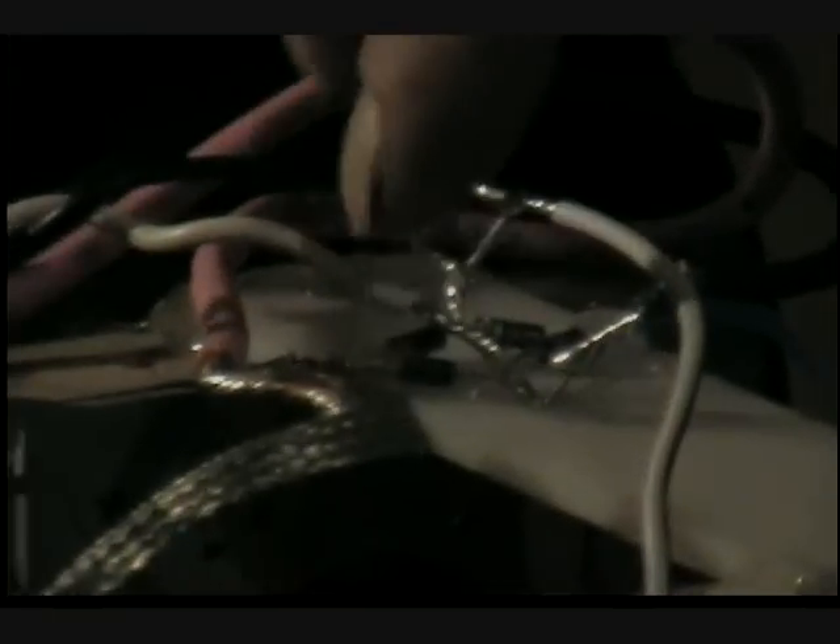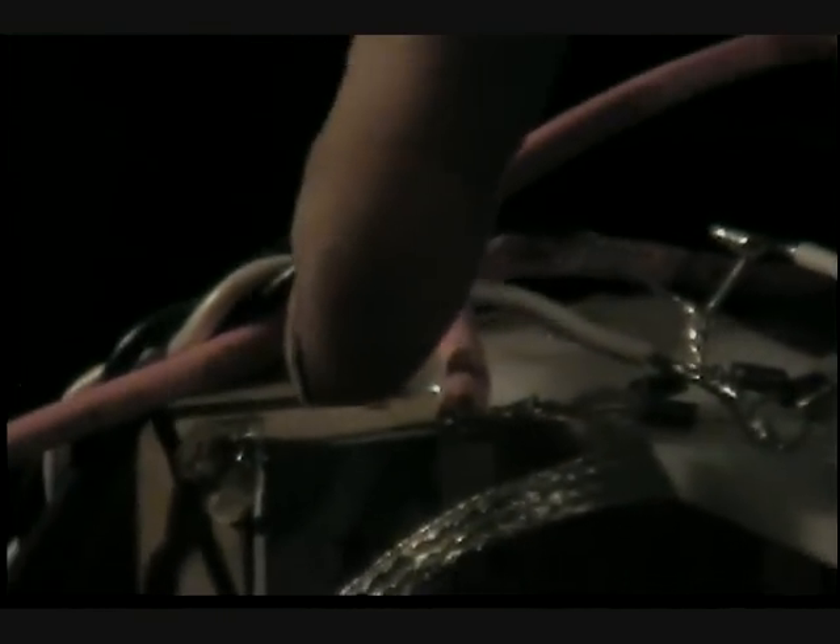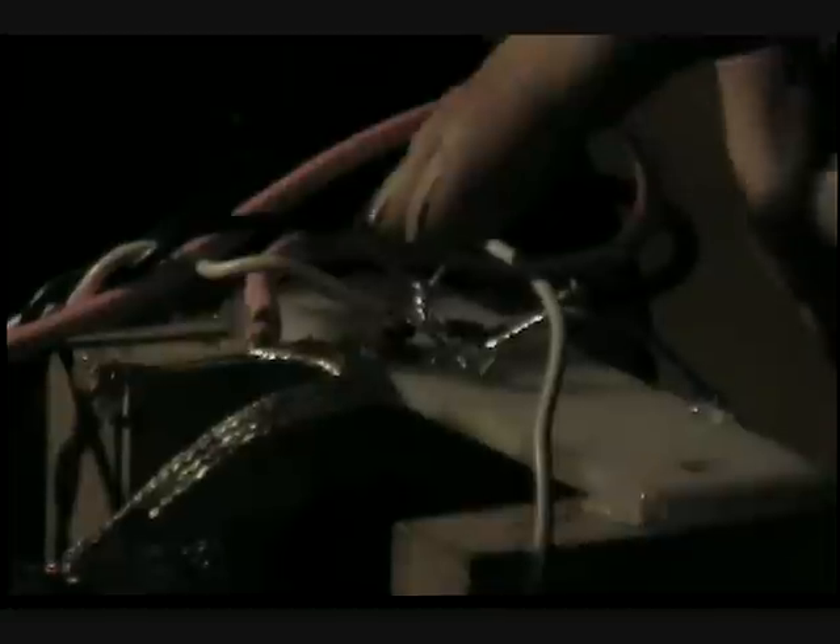The coil comes in on the AC side of the rectifier and leaves DC, which is common. So what we've got is a pink positive out and a black negative. What's uncommon is tied into the same output — or input from the coils to the bridge rectifier — is basically a capturing circuit. With Bedini, we're trying to capture this radiant spike that appears after the magnets have passed the coils. If you can close the circuit at the right point in time, you can capture one of these spikes — actually you can capture more, and I'll show you.